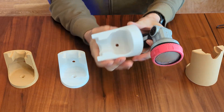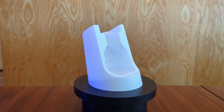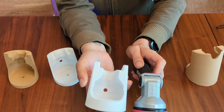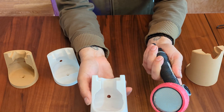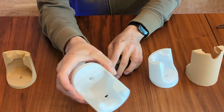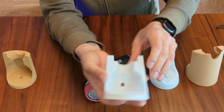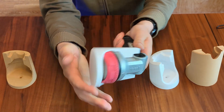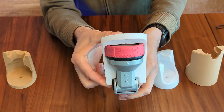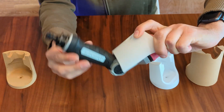Here is the first of the scanned versions. You can see I made a mistake — there's no way to get the sprayer in there. That hole at the top is too small. Even though the sprayer would perfectly sit into that cavity, it's not going to happen. So here's the third version — I cleaned up some of these edges, widened things out a little bit, and we finally get something that fits. Nice and snug. You can see how well that contours to the edge of the sprayer head. But this is still a little too snug for my liking.